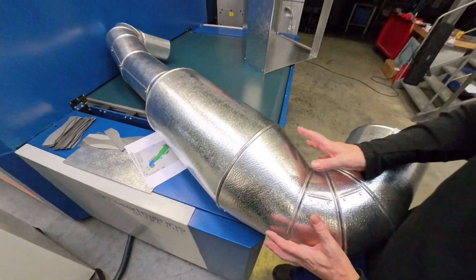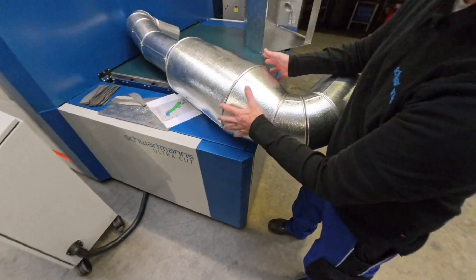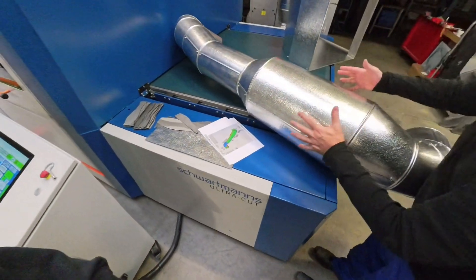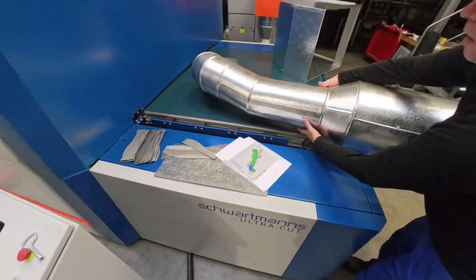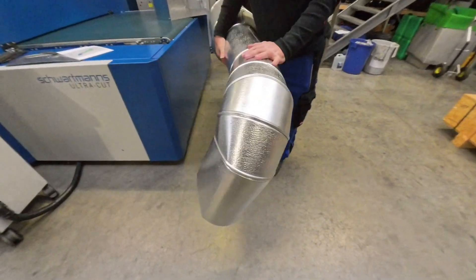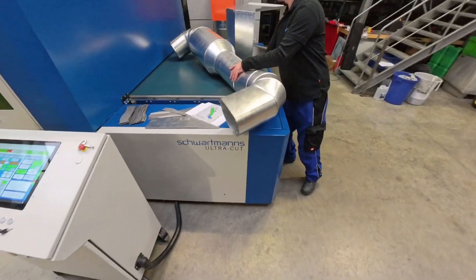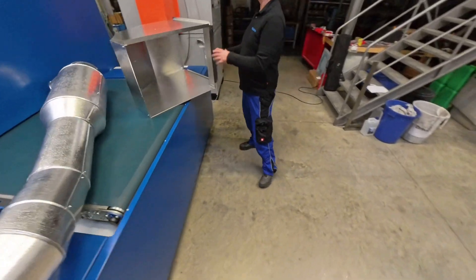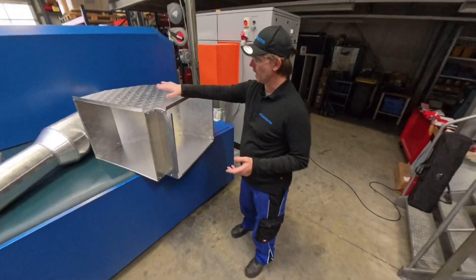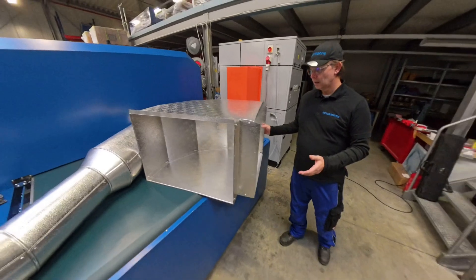So this is what we have: a band lying here, and I made this end segment going into a cone as a reducer. Then we have what we call in Germany a 'Bombe' — when you have two reducers and a large diameter in the middle. And here I also made a flattening with triangulation. This is the result from the UltraCut laser cutting. The ductwork piece depends on the specification — what kind of overlap you want, you can also put diagonals in. I kept it as simple as possible just to show it in the video.